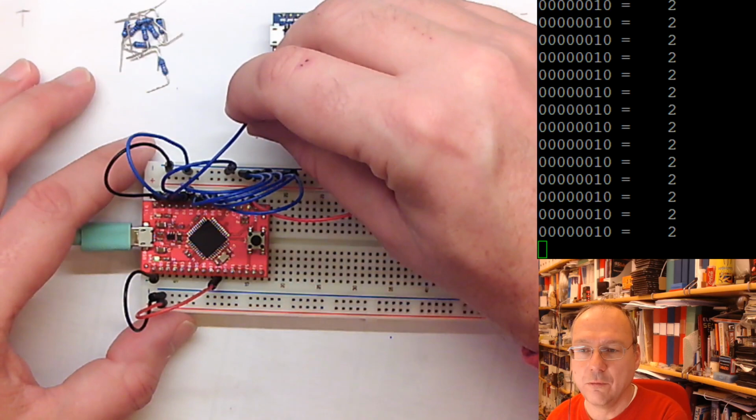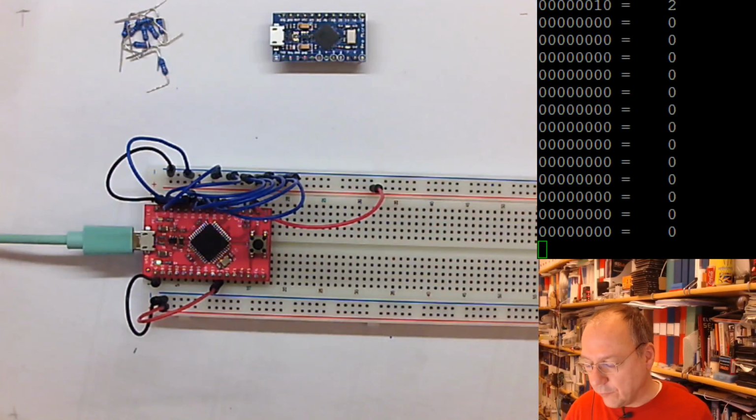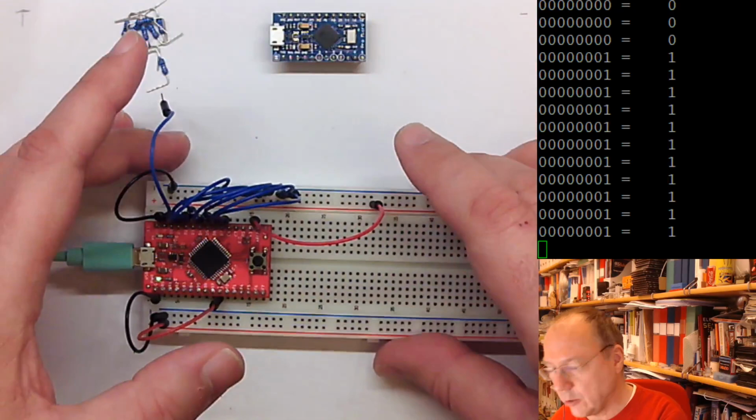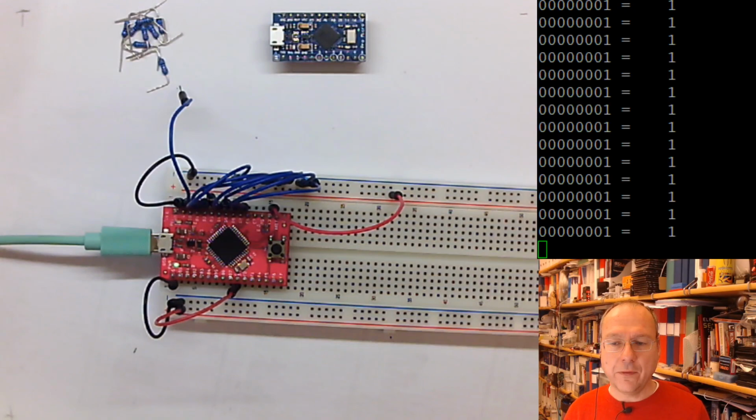So why do we have to connect the pins to ground as I did here in order for them to show up as zeros? Why is an open wire like this interpreted or seen as a 1? And there are two things to this. One thing is that actually I activated the so-called pull-up resistors